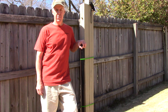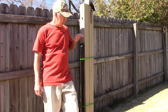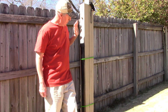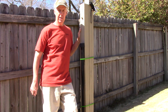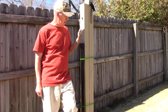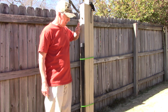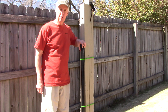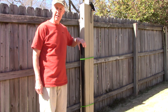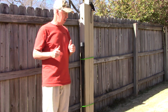Here's another option for your home QTH for the Spiderbeam mast. Take a 4x4, dig a hole, and sink it in the ground in your backyard somewhere — it doesn't have to be but about 4 foot high. This one I've got cemented. You can strap your Spiderbeam mast to the pole and just leave it there with your antenna on it, and when you say you're stuck in that HOA, just deploy it.